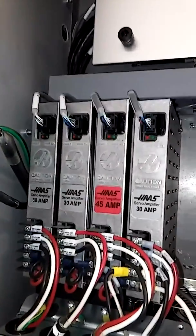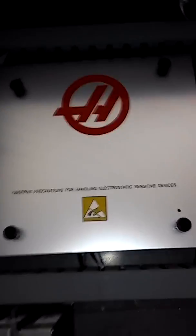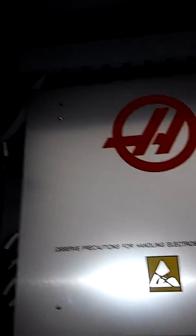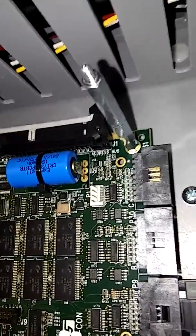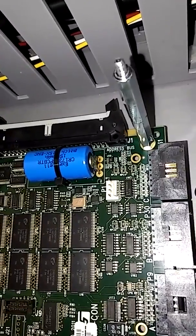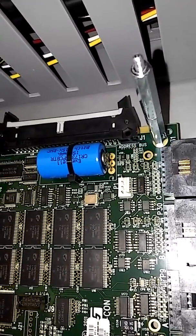This unit up here is the main PC. On this style machine — there we go — that's the main board right there. There's our battery and our battery port: that white four-pin connector is an external battery port. We're going to utilize that for our external battery, and we're actually going to remove the battery from the main circuit board because that one's dead.